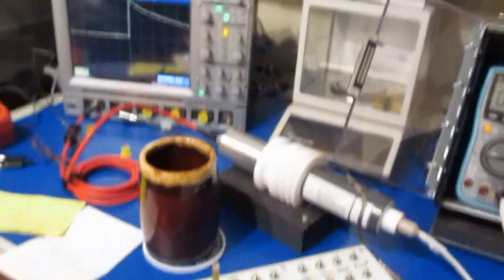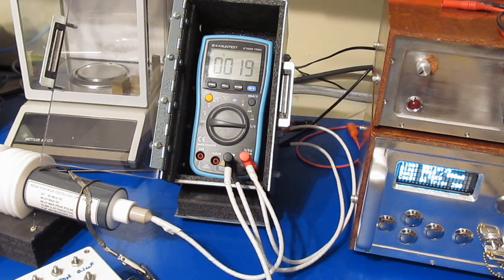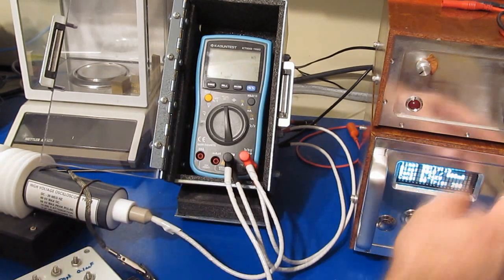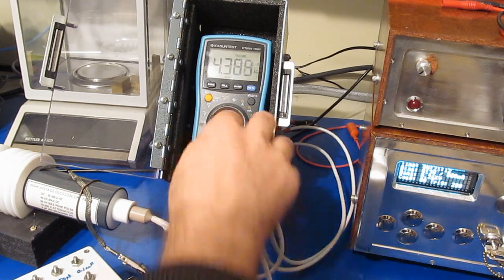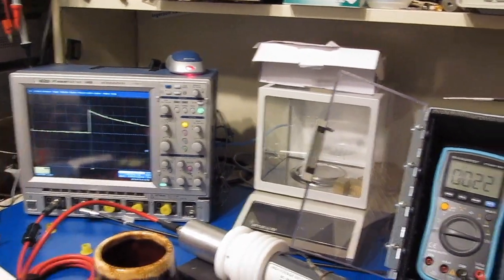Anyway, I now have the transient generator set for 2000 volts. You can see it's still 500 volts per division, or 4 divisions up. That's it. Looks like the KT6000 passes functional just fine. You can see I've got the transient generator now set for 2,500 volts.